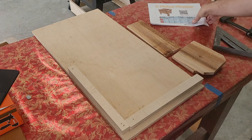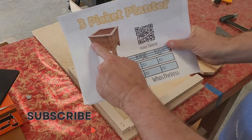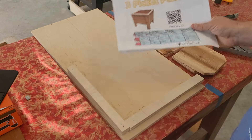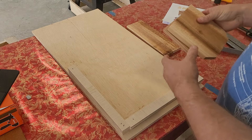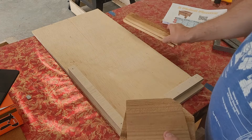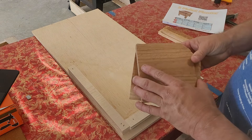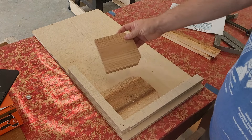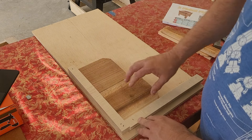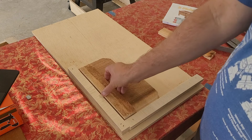When you are making the planter boxes, you're basically forming the sides first and then attaching the side pieces with leg pieces. Take the side pieces and press them into the corner and also against the fence, making sure they're flush against the fence. Then put your glue down and nail the leg into place.